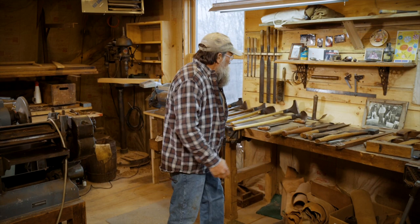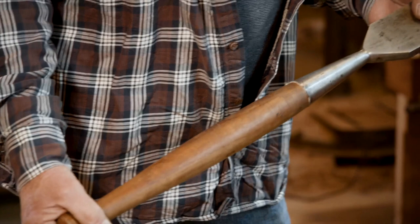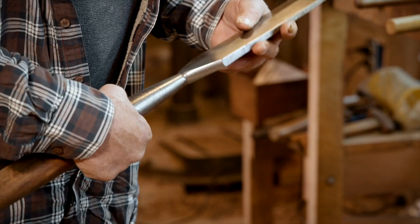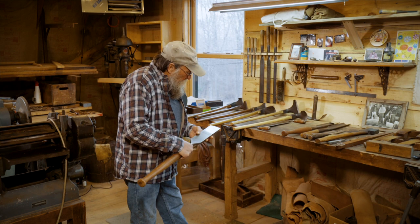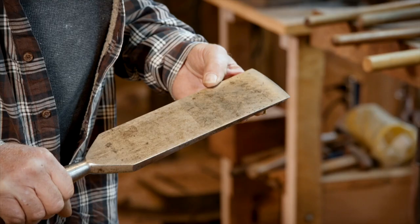This is a slick, which is one of the tools that you're going to use — maybe not every day, but a lot. These tools are very useful for doing all kinds of things — for shaving wood or for hogging wood. You can remove a lot of wood, or you can split a pencil line with the thing.